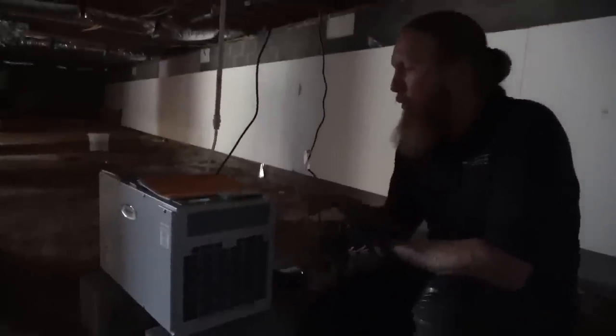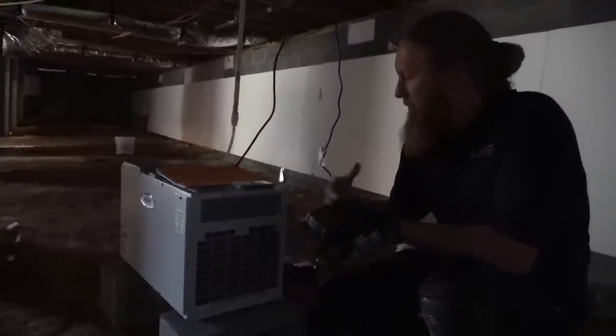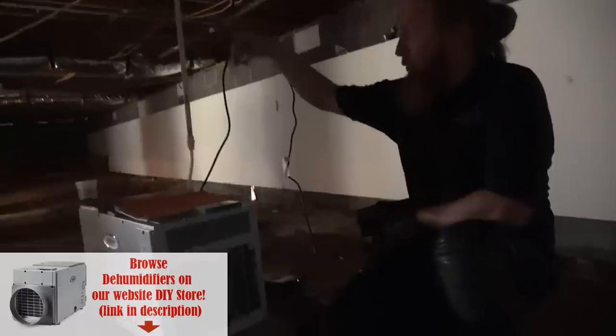There's some of that foil I was talking about — we're going to remove that from the subfloor and make sure the dehumidifier dries all that out. I'm going to show you the dehumidifier we've got running. This is the Aprilaire 1830 — this will do up to about a 2,200 square foot crawlspace. It pulls moisture out, moves about 70 to 75 pints a day. If you've got a bigger crawlspace, go with the Aprilaire 1850. We've got it sitting up on blocks, draining into the condensate pump, which then pumps the moisture out of the crawlspace.